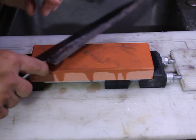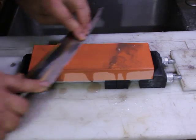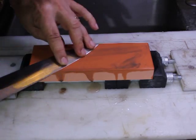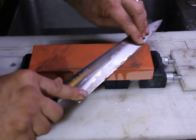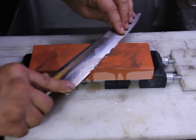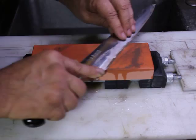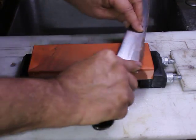So we can see it's a shiny edge. Let's work the other side a bit. Again, very slow water absorption, so this is very much a pure splash and go sort of stone. It has a hardness very similar to the 1000 speckled Ume in either the hard or extra hard grit, kind of in between those two. So this would be a very nice combination to use with that stone, perhaps with an intermediate stone, at least for the powdered steel from what I'm seeing at this point.